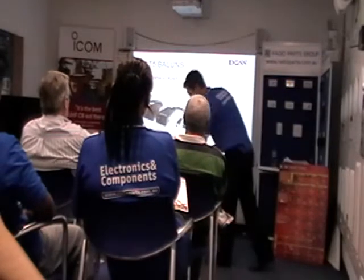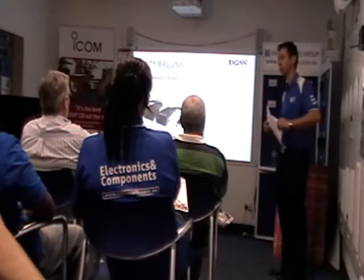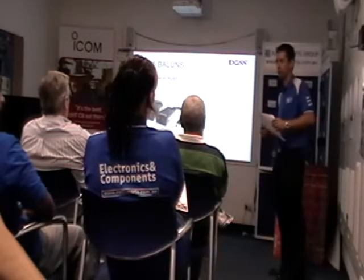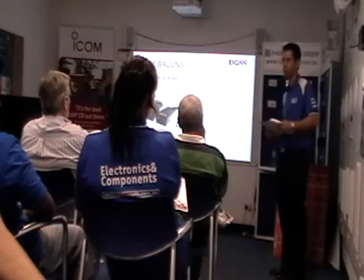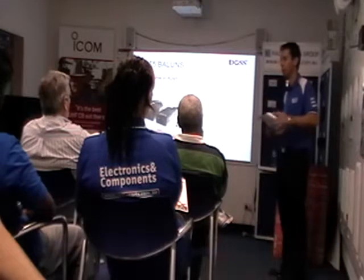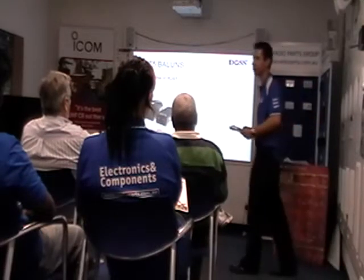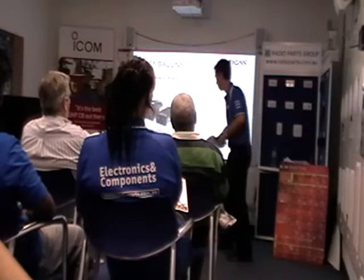Our CCTV comm cable has been tested over 100 metres with the voltage drop. It doesn't really drop all that much, so it can still run, and it's still about 700 TV lines. It's composite, obviously, 576. We test our stuff up to 100 metres, and after that it's anyone's guess, I suppose. It depends on the situation. And then the Cat5 you'd use for longer runs.